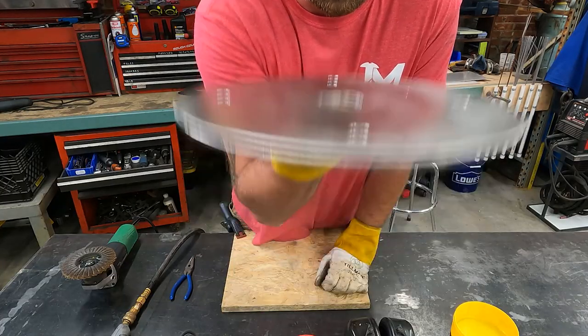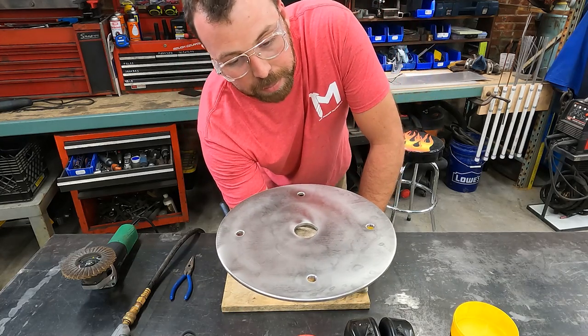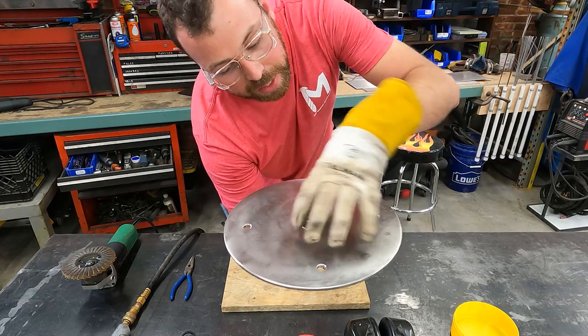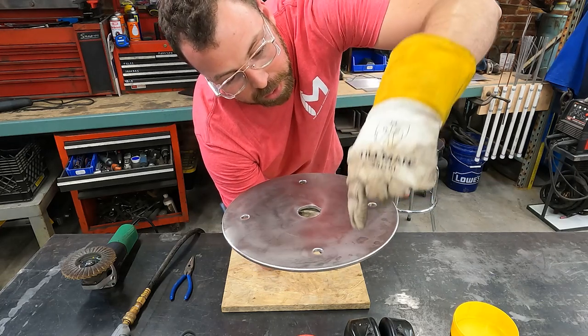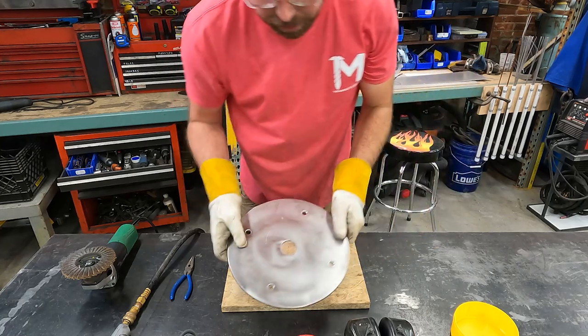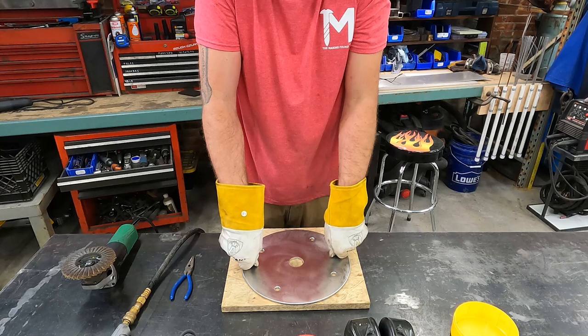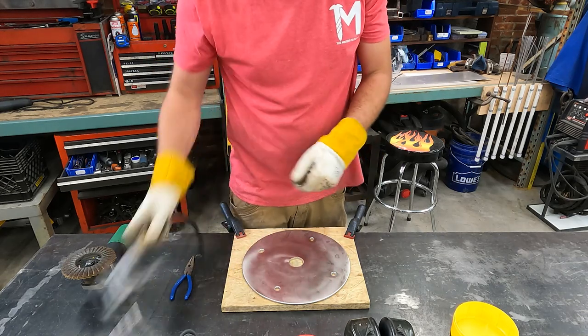This thing, because it sits down in a cylinder, you can't really get your hand in there to get it out. The old one had a little handle on it that he picked up. So this one, we're gonna weld two little hoops here and here so that when it's down in there, he can grab onto something and pick it up that way.